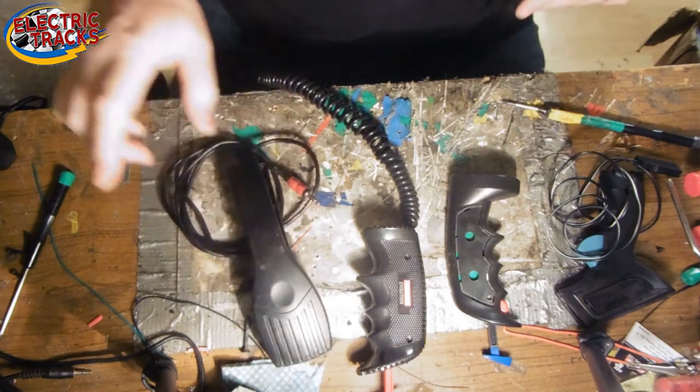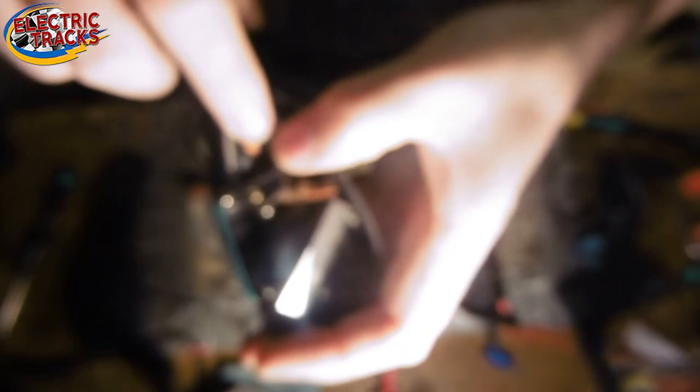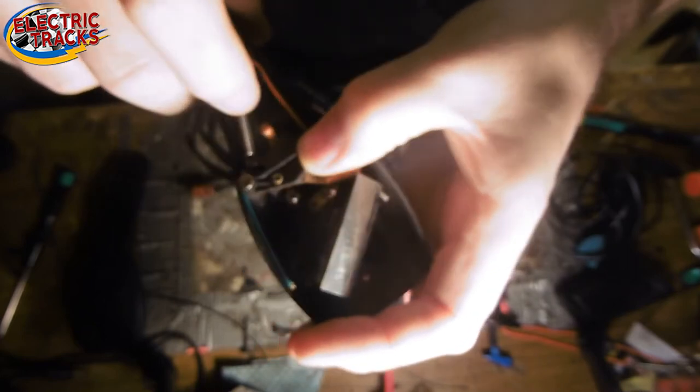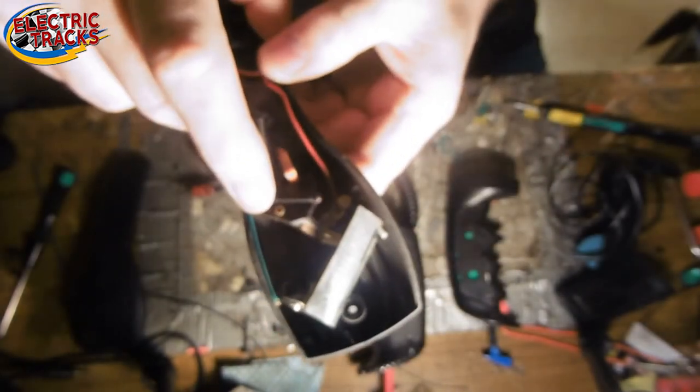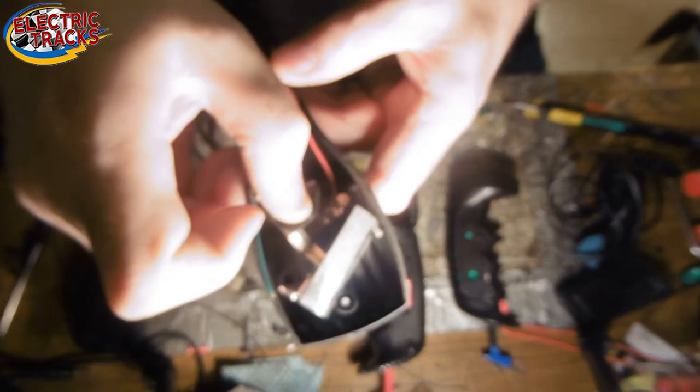There is one before this one, and we'll look at the differences briefly. Why do these go wrong? It's to do with this section here — as you drive and you press and you release, where the trigger and the swing arm connect, it digs a hole in it. As you get further and further into life, the swing arm isn't going to the end, it's going to just shy of the end.